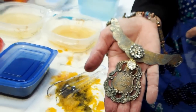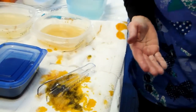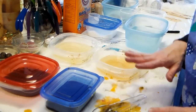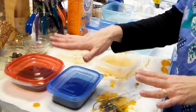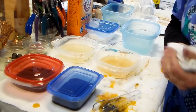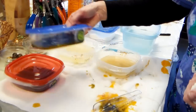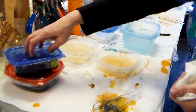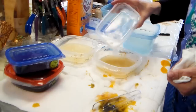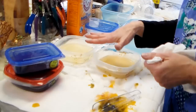is very popular now. So, a quick couple of notes about cleanup. I think we mentioned earlier there are material safety data sheets out there regarding what brand of ferric chloride you're using, and they tell you the proper disposal. We are going to keep what we're going to reuse in plastic containers that are marked properly with Mr. Yuck and that they're etchant. These we are going to neutralize further with more baking soda, and then we're going to put that in an appropriate container and dispose of it according to our local laws.